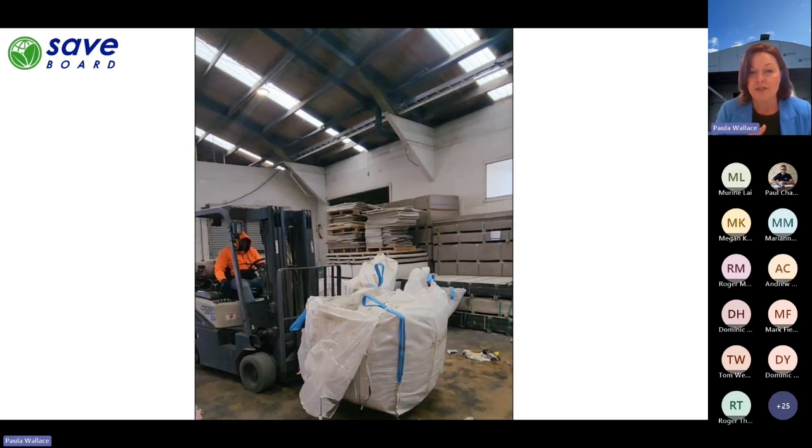And that 100mm bed will be compressed and heated so the plastic melts. So we will heat and compress, heat, compress, release, heat, release for about 5 minutes for a betterBRACE board. Last stage is cooling, and out comes a really high density 10mm board. betterBRACE is then sprayed and stenciled to identify on site.